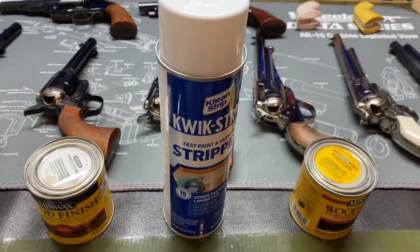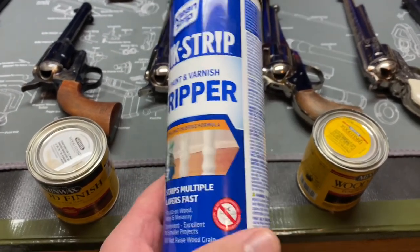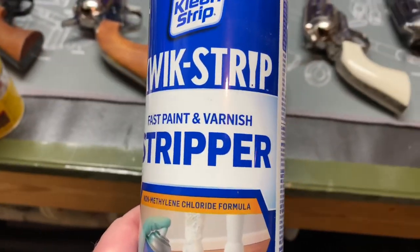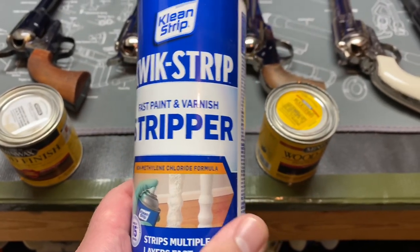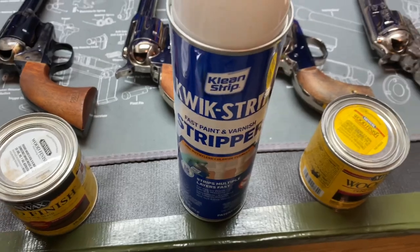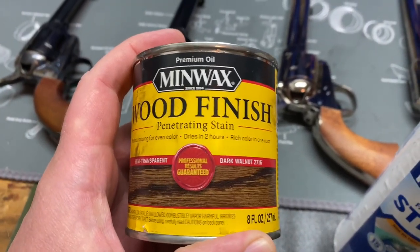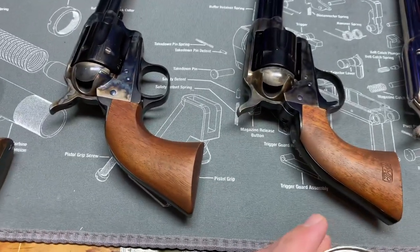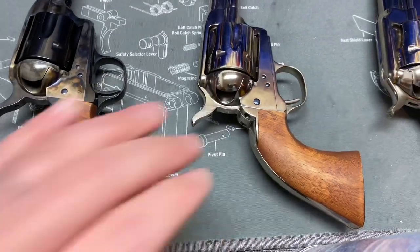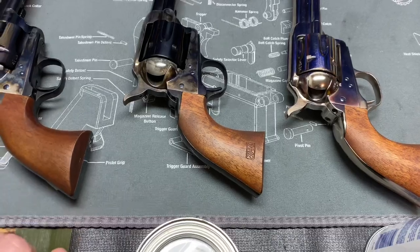You don't need anything really special — I got all this from Walmart. I used Quick Strip, a paint and varnish stripper that sprays on like a foam. You just let it sit for a little bit, then use a mild abrasive like 000 steel wool, and the finish just comes right off. You might have to do it a couple of times, but that's what got all the varnish and the gloss off. For the Cimarron guns, after getting to bare wood, I used Minwax penetrating stain in dark walnut. Depending on the wood itself, there are three different versions of how the wood took the stain — it's all the same stain, but one came out very light and another is more marbled. It just depends on the wood of your grip.